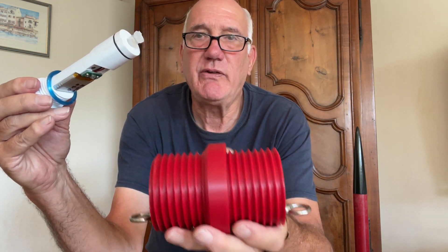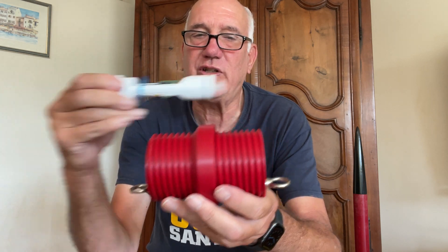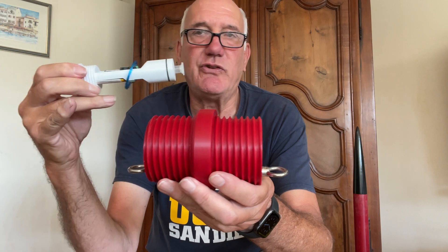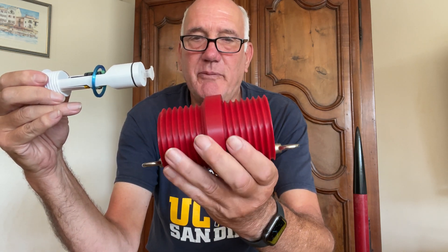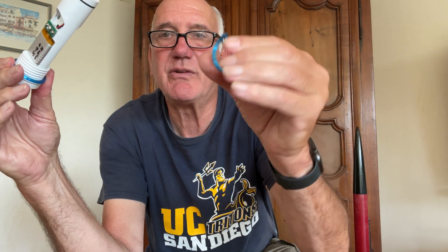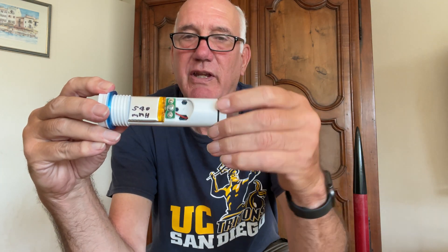With just 50 millimeters or two inches of threads, this thing is rock solid — it's not going to come apart. There's a hole here that is lined up with one of those screw on-off switches located on the e-bay cartridge. Here's the lithium polymer battery. This is designed to be totally free of any possibility of hot gases getting inside the electronics cartridge. There's a 3D printed gasket made out of TPU so it's flexible, and then there's an O-ring on this end that makes it gas-tight.